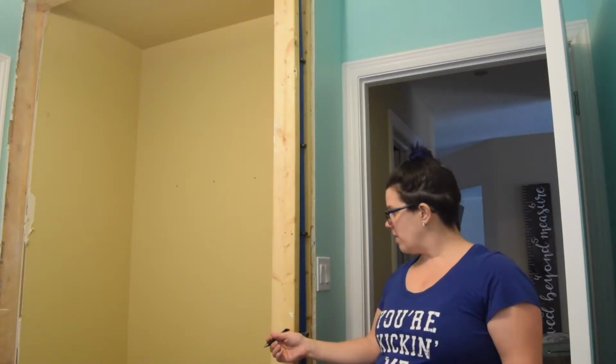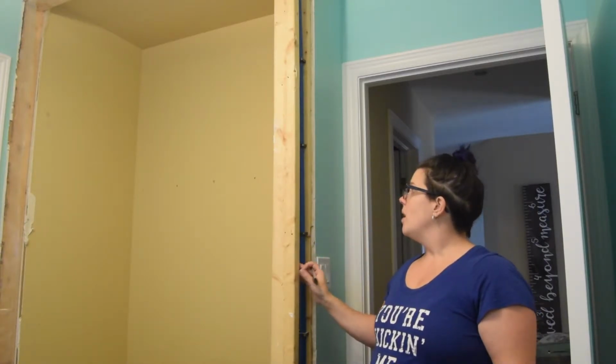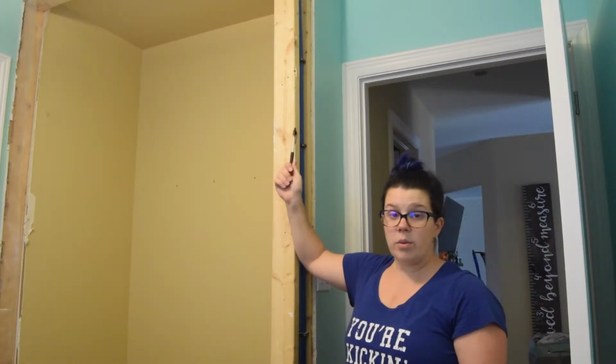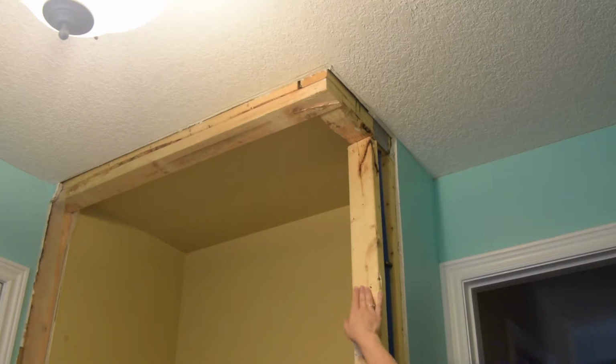I'm not going to bother putting anything on the front of this because we're facing it with the white MDF, like how you would trim doors. And then we'll be putting trim around it because, I know you can't see from here, but I'll show you later, there's no easy way to take out the top plates from where the closet was framed in. Up there, like that, L shape. There's no easy way to take those pieces out and finish the ceiling so it matches all the way across. We have the orange peel style ceiling here, but inside the closet it was just flat. So the same way we're going to face this piece, we're going to face the top and then trim it in on both sides, on the outside and the inside, though we might just do the MDF on the inside. I don't know, it doesn't really seem necessary to put a piece of trim, but I think we have enough trim, so we'll just have to see what we have.